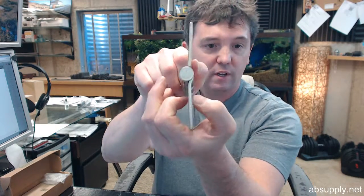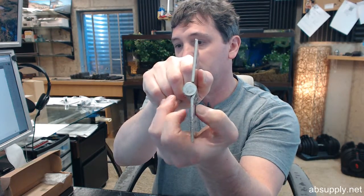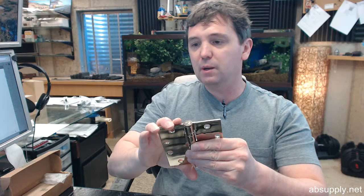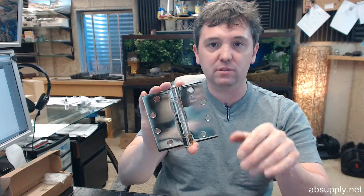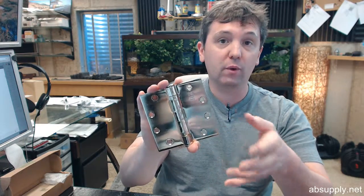It means that it is a steel base hinge. That's certainly inferred in the 5000 series part number, and another part of the part number we'll get to. It's going to mean that you are dealing with a standard weight hinge, 134 thousandths of an inch leaf thickness, and it means that's a hinge that is not wide throw or not unusual. You're going to get a BB 5000 in common sizes, 4.5 by 4.5, 4 by 4, 3.5 by 3.5, 4.5 by 4, things of that nature.